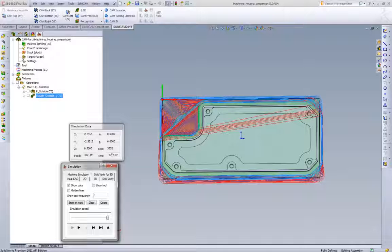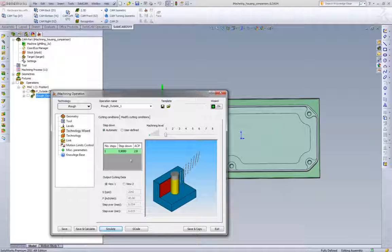Now even if we do this, we see we get the 17 minutes. So that is 2 minutes more than what the standard rough cut did with the standard offsetting. Yet we're actually still running a little less RPM and feed rate than we were in the pocketing, because this is only 2,200 RPM as opposed to 2,500. So you can really see that with iMachining, we're giving you a lot of choices here with the feed rates, and the user doesn't have to worry about all that synchronization.